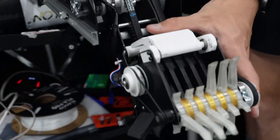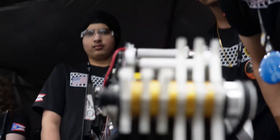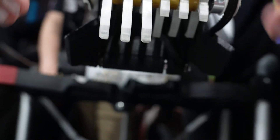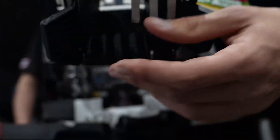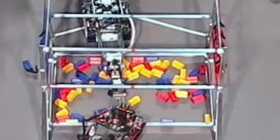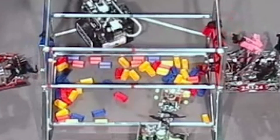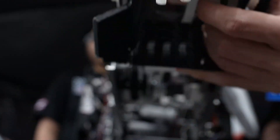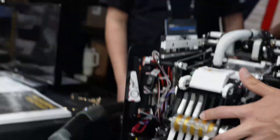The large teeth and smaller kickers serve a specific purpose: the long teeth are offset at 90 degrees. So if a sample comes in sideways, it'll hit one side first, which rotates it into the vertical orientation. It has to enter vertically to fit, and this self-centers the pieces. Then it kicks them back into the door, which is spring-shut, and transfers them off to the claw.